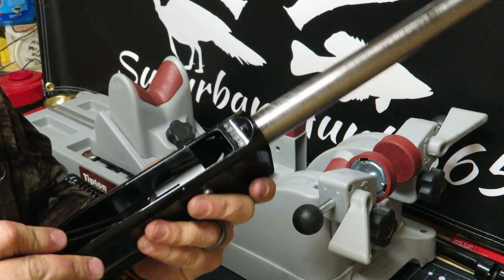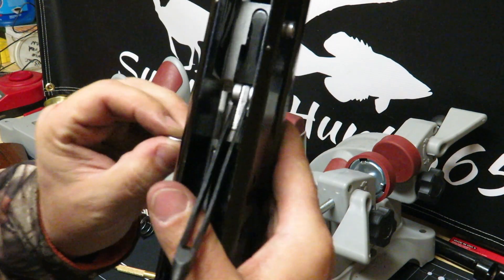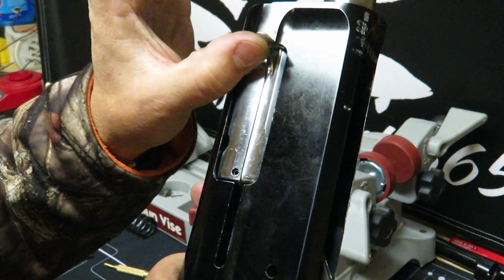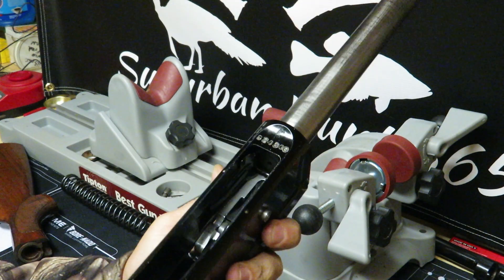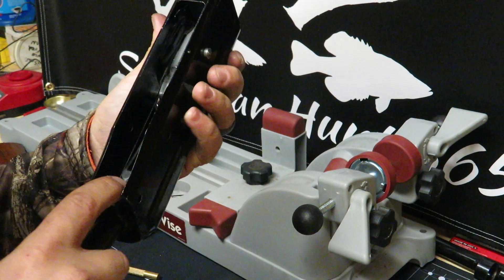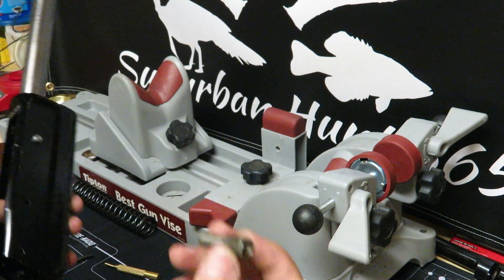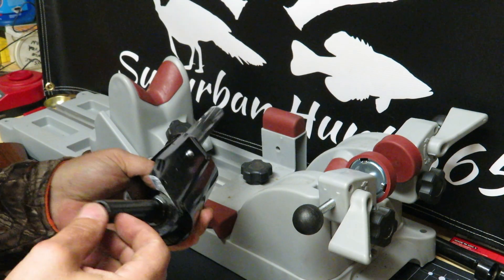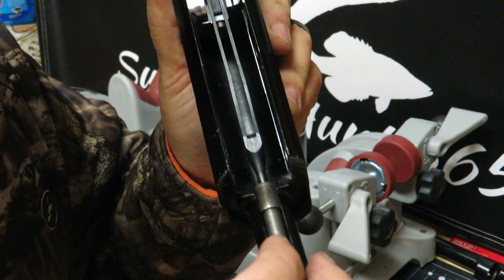Keeping the link clear, pull that back and now you're in place. You can actually line this up with the bolt and it lines up just like so — that pushes in just like that. Now you've got all that back in there. Press your link back into this groove here, then go ahead and put your follower down inside this tube and send it home — that'll actually keep that link where it's supposed to be.